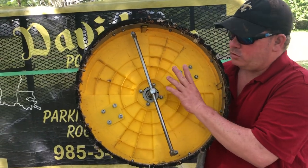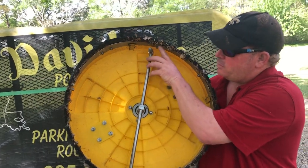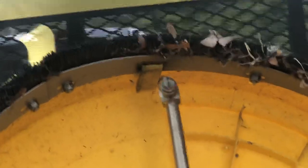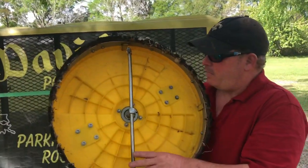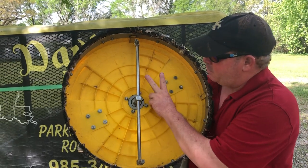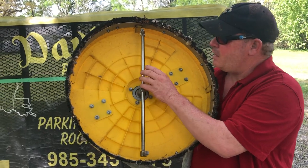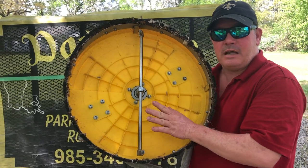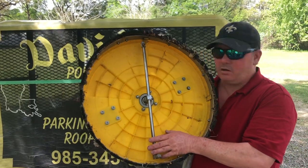The other caveat about these tips is the apex — the degree that these tips produce. These right here are probably 15 degrees. If you are doing heavily soiled concrete, these tips would be optimal. You'd have a 15-degree V spray pattern — that's the first number — and these tips would be a 04, for 4 gallons per minute per tip.